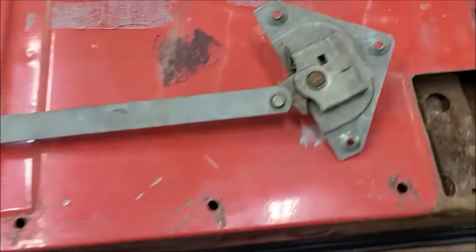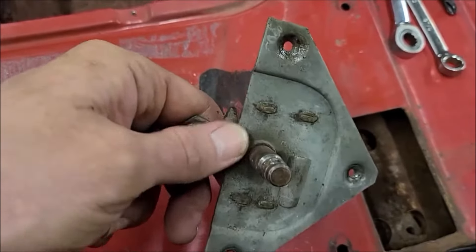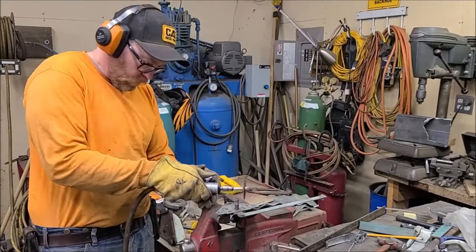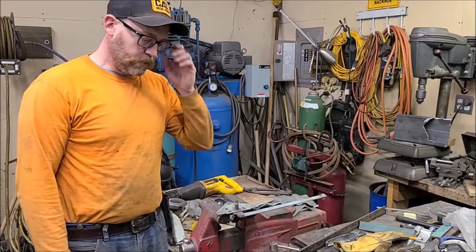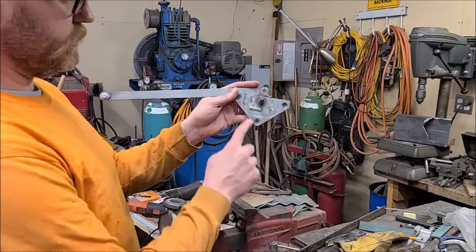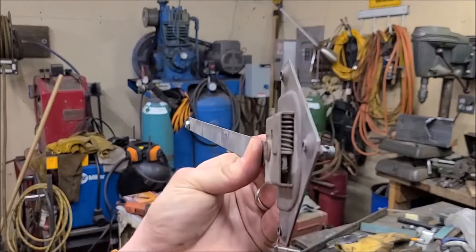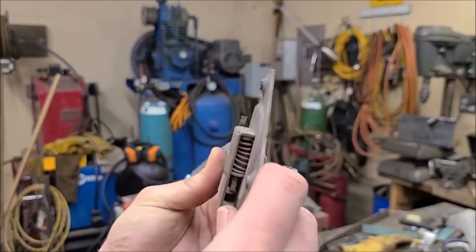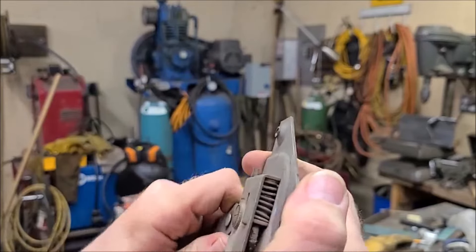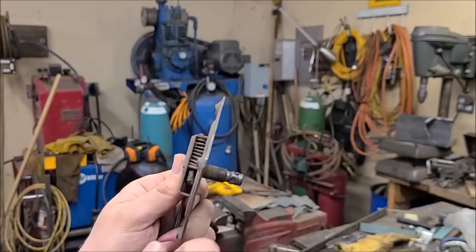Let me give you a closer look at the back side of this gear. There's a spring in there you don't want to lose. These are the tabs I need to grind to get this disassembled. I got it all ground down. Now the trick is to get this thing apart without it flying apart. There's a little raised spot right here — you can see that spring in there. That's what you don't want to lose. As the handle operates, that spring is what lets the handle kick back up when you actuate it.